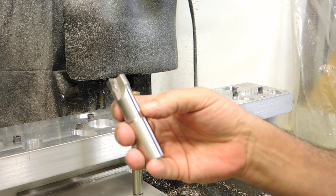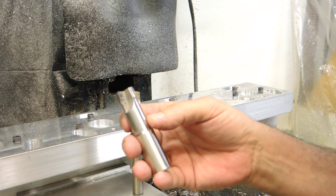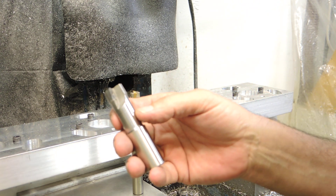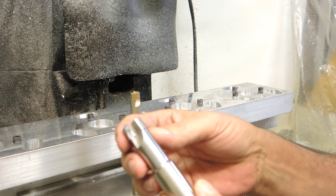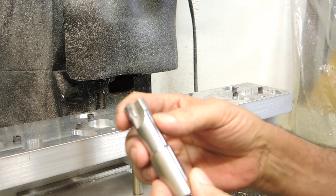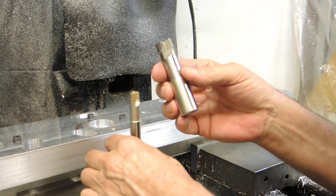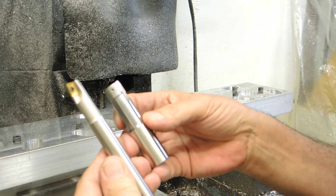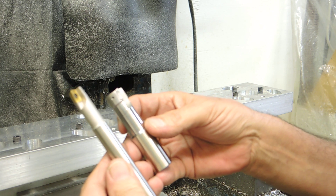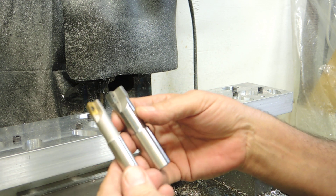Today I just want to show this one cutting because I've got a plate here of PM 940 top plates and I'm going to cut a slot. I've been using the insert cutters in places where I can fit them in. This is a 20 millimeter and they come longer like this. They're really inexpensive — some of these tools are like 10 bucks. I used to not look at these years ago because the inserts were expensive, but they also have cheap inserts.